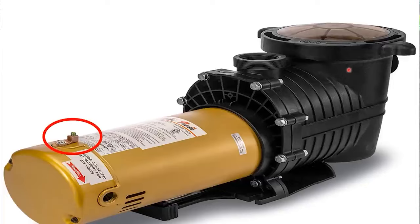Let's talk about conduit. Here's an example of conduit run underground — they chose rigid metal conduit, so they only needed to be six inches deep. In my opinion, conduit would not be required to be bonded until it breaches that five-foot mark, at which point you'd use a listed clamp around the pipe and attach it to the number-eight bonding conductor. If you had a rack of conduits they would have to be bonded together — either with a bonding bushing and a number-eight jumper, or you could run a piece of number eight from clamp to clamp and then jump over and tap onto your pool bonding circuit.